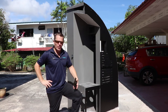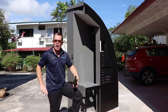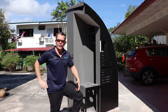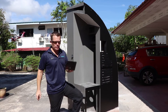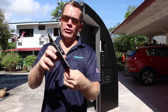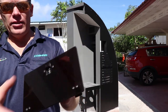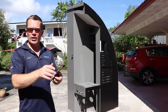It's been about a week since I started this build and I've just got two parts left. I've got about an hour before I have to go to work, and I'm hoping to get this finished so I can get this video published and then move on to the first officer side bulkhead. Here in my hand is the latch panel that I created last night — it's just a Perspex panel with 3D printed hinges and a 3D printed latch. It's got a big silver spring in there to keep it closed. Hopefully I'll paint that black just to hide it.